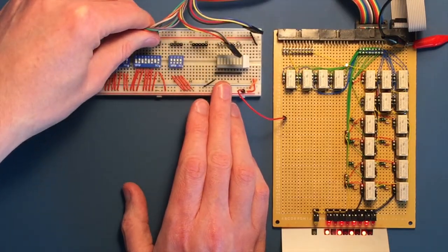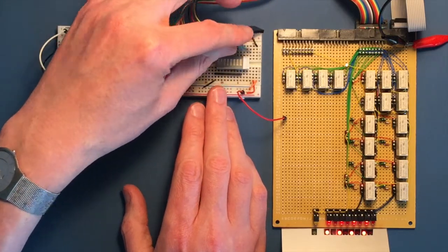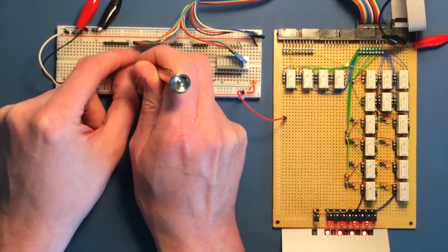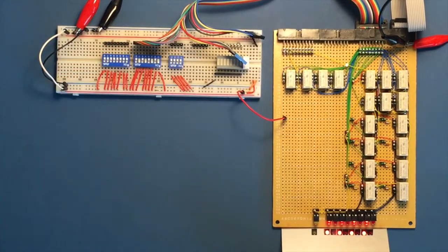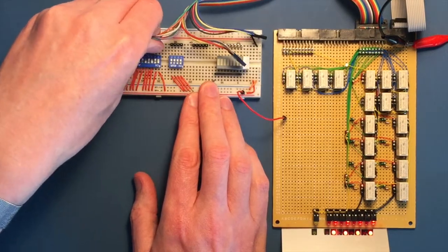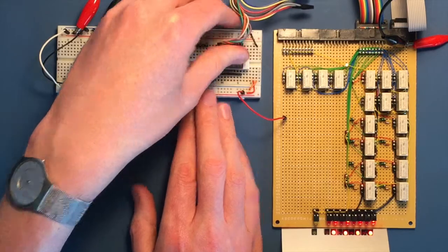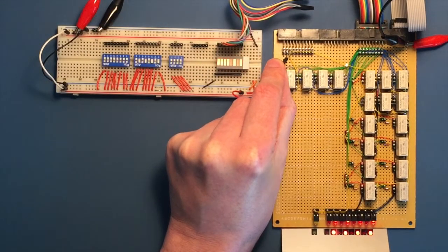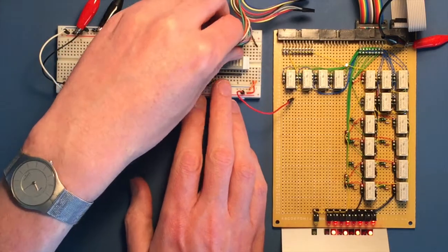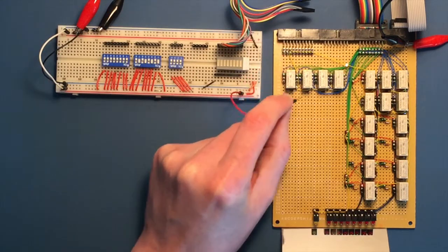I'll now put the off, on, off, on pattern into the register and then repeat the same process. Again, the lower 5 bits of the instruction register are gated onto the data bus. But note that this time, because bit 4 is set on, bits 5, 6 and 7 are also set on. This is effectively using bit extending so that you could load a negative number from the set AB command onto the data bus.